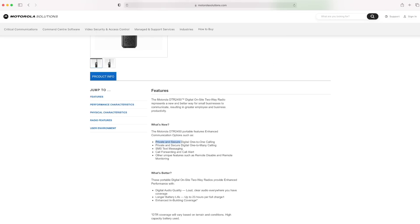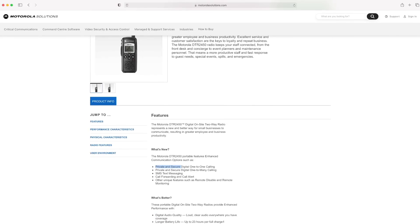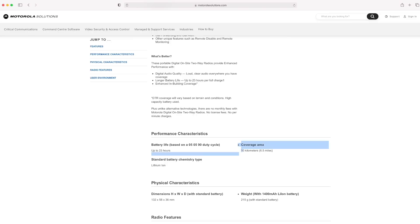What's quite interesting about these radios is this claim of 'private and secure.' These radios operate on 2.4 GHz and are digital, but they use a kind of spread spectrum technology — a bit like Wi-Fi — which means it's virtually impossible to eavesdrop. You won't be able to fire up a scanner and listen, and whereas you could find information online to decode some other digital protocols, these are super secure. There's also some claims on here I think are completely ludicrous — coverage of 10 kilometers. There's no way a radio like this covers 10 kilometers. Maybe if you were standing on a mountain with line of sight to another mountain six and a half miles away, but through an urban environment it's going to be very very low range.